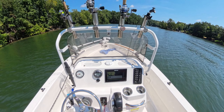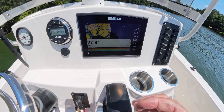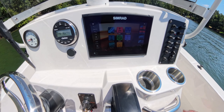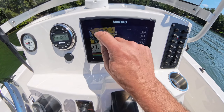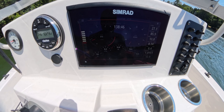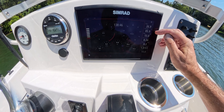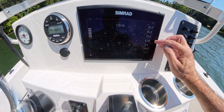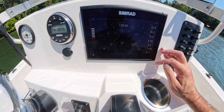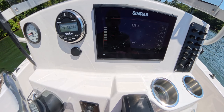Pretty basic electronics configuration here — I installed all of it myself. On top is my Minn Kota compass for the trolling motor, and this is the Simrad Go 9, which I really like. I hooked up the instrument display from the Yamaha outboard using the Yamaha data cable, so you get all of the Yamaha engine data output into the Simrad. It took me forever, but probably my greatest accomplishment was figuring out how to get trim and tilt data from the motor's trim and tilt sender over to the Simrad. I did post something on Facebook about how to do that, and if I can find the link I'll put it in the description.